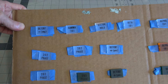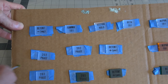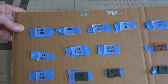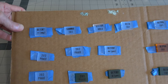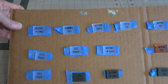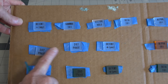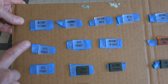This is on a video on the B9 Robot Builders Club — Dave Shoupias did one on this. Once you fill in the letters, you just let it dry about three minutes or so. Then all you're going to do is take a flat piece of plastic like a credit card, something completely flat. Wrap a paper towel around it, dab it with your finger just to make it a little bit moist, and then wipe it right over the surface. That's going to wipe the paint right off the surface and leave the paint inside the letters.